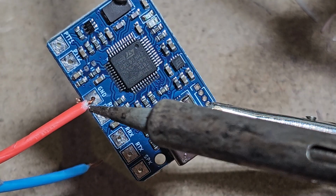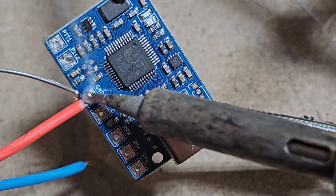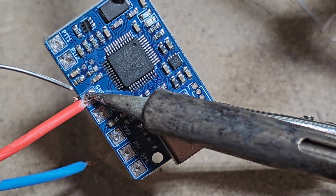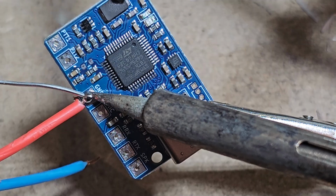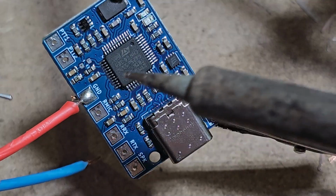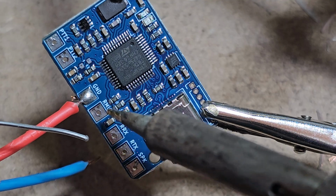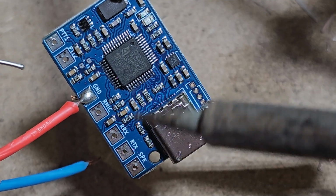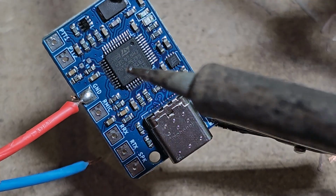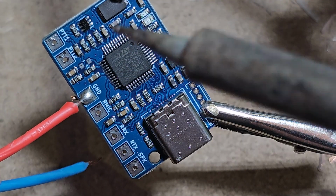All right, so this is heating up nicely. Put some pressure on there. You likely know how to solder if you're getting one of these, but these are easy solder pads, so even if you're not an expert, it's designed to be really simple and easy. And even if the solder isn't perfect, because we have it pushed through there, the inside of the hole is also lined with metal that is a connection. So as long as it's held in place, it's going to be a good electrical connection. So pin 2, the thick red, is now attached to ground.